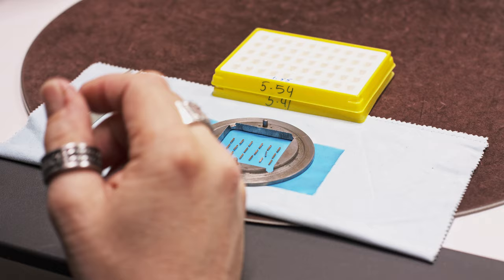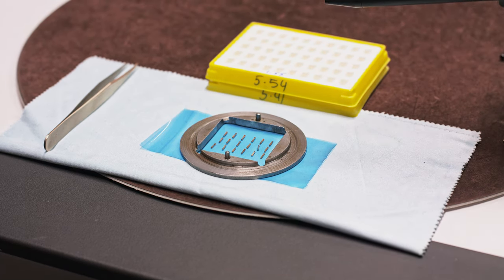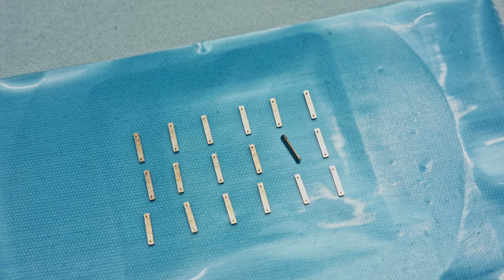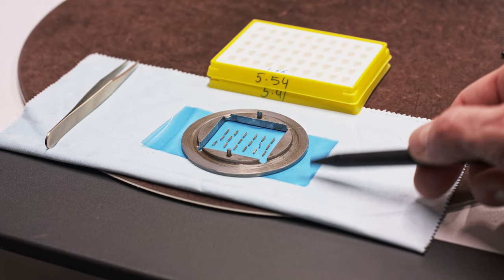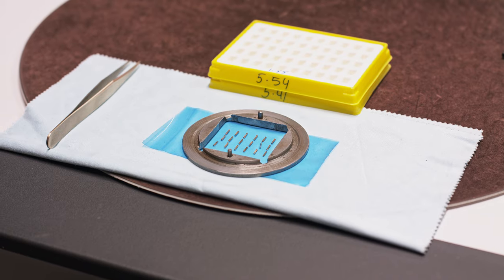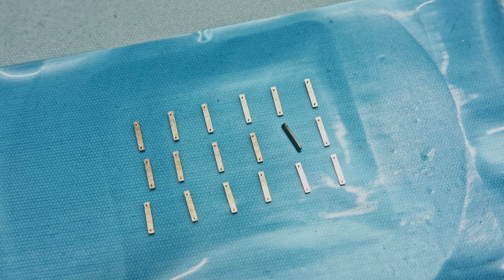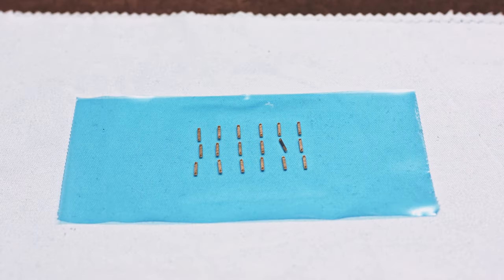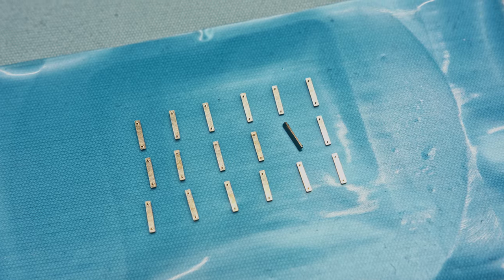There they are! A blue scotch tape surface is used so that when he does his operation the indexes fall down without touching each other — because if they touch each other after falling out they are waste; the surface is so delicate. The tape glues them in position, minimizing the risk of contact to almost zero. They still have their tiny little feet — 0.18 millimeters in diameter, 0.45 millimeters in length. The entire index is completely finished, and from here it goes to stock. When the dials and watch heads are assembled, the indexes are taken directly from here with no additional operation done.